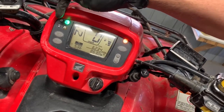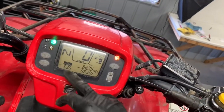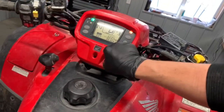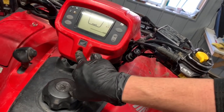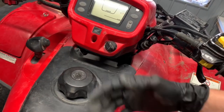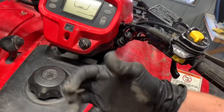We've got an oil temperature light there, your four-wheel drive button there, and here is your reverse. Here's your reverse light, and then reset and adjust. You've got your hour meter there, and we also have your power steering light here. You want to make sure you've got a fuel hose here — typically what you want is a fuel hose that goes from here, shoved in there. That allows your fuel tank to vent, and if you've got a full tank of fuel, the hose runs up to here and underneath your dash so that fuel sloshing around more than likely isn't going to get all over you.